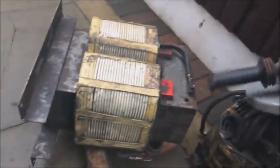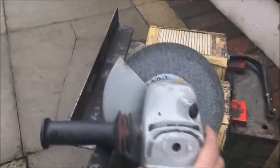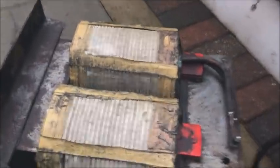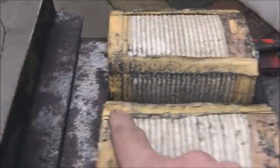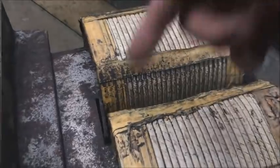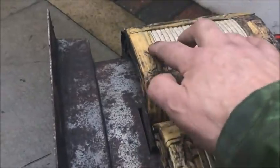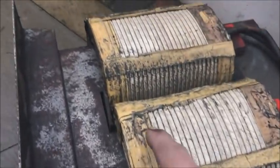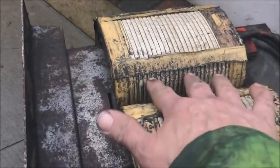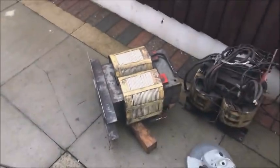As quick as possible is a nine inch angle grinder. I'm going to lose a little bit of copper dust, but the savings in time are worth it. You can have a look, you can see the construction. My plan is to go straight across there, spin it round, straight across here, turn it over, exactly the same. That bit should fall off either side, and just leave these bits in the middle to hammer through. I'll set you on the tripod and let's get at it.